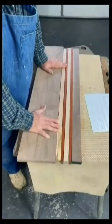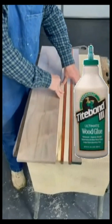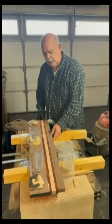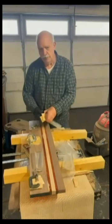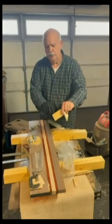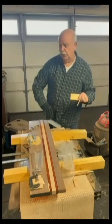Make sure you're using Titebond Premium 3 — that's a very strong wood glue, stronger than the wood itself, and it's food safe which is important. I wanted to show you a tip: some of you might hate sanding and peeling off old glue. When using clamps, put scrap pieces on both sides to keep it level so there's not a high or low board. You don't want to compress the grains because then if you stain it later it won't accept the stain as well as the surrounding area.